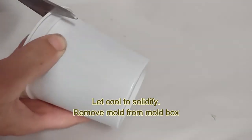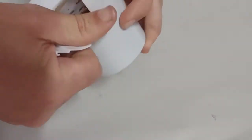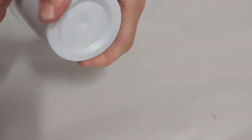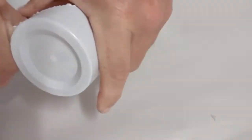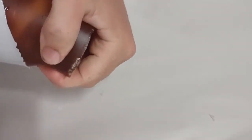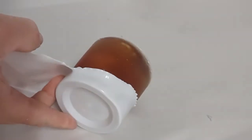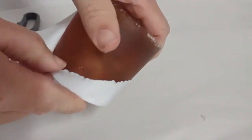After it has cooled, we cut off the mold box and we have our mold. The composite mold can be continuously reused as many times as you want. When you melt it, make sure you don't boil it, because that will make it darker and after a while it will add bubbles into the mold. Composite mold melts at about 130 to 135 degrees Fahrenheit. You don't want to get it above about 180 to 190 degrees Fahrenheit.